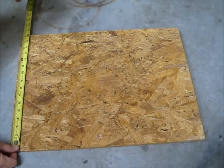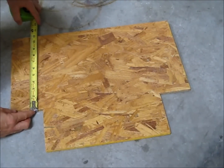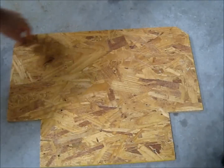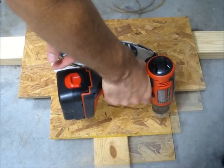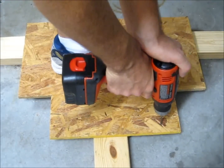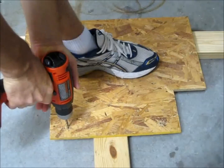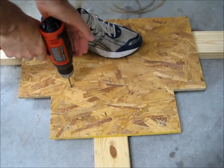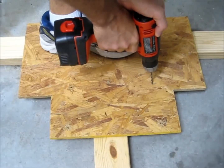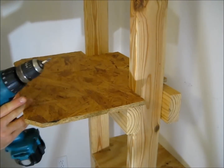For the second and fourth shelves, cut two pieces of plywood 16 inches by 21 inches. Then cut a notch to leave an 11-inch platform in the front and 13.5 inches between the poles. On the second shelf, cut the corners off the outside corners to prevent injuries. Then drill two holes one inch from the back and two inches from the side, and also drill two holes six inches from the back and six inches from the side. Put the shelves in place and attach with four screws.